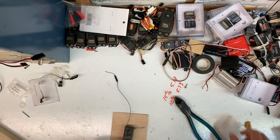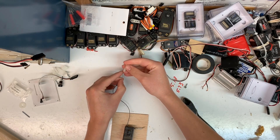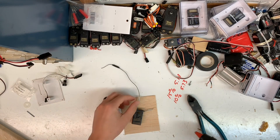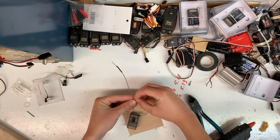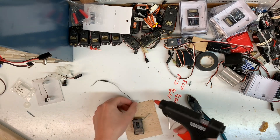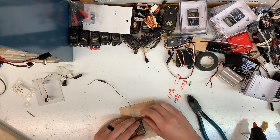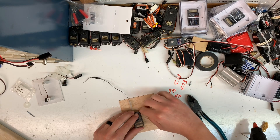You're going to do the same thing with the second antenna. Because it's got heat shrink on it, I actually had to cut it, split it, and slide it back over the antenna — that's not a huge deal, it's not going to mess anything up if you need to do that. Go ahead and put some hot glue on this piece as well. We've moved this one around enough that it's slid out, but once it's permanently mounted in your plane, it's not going to go anywhere.